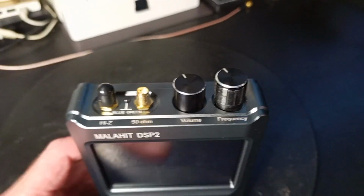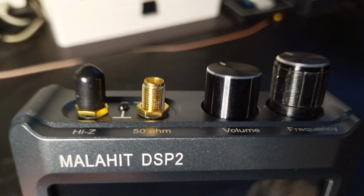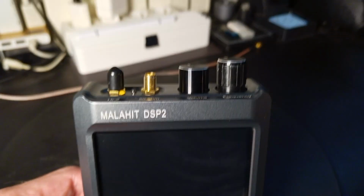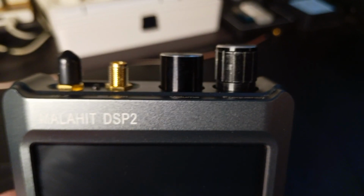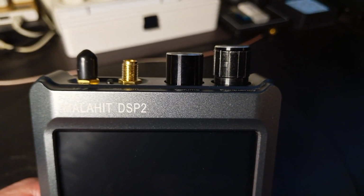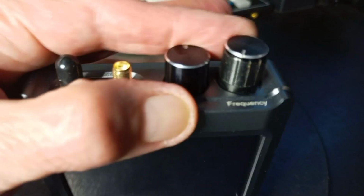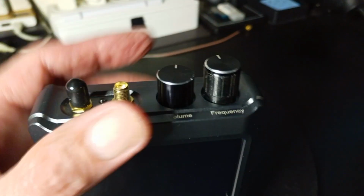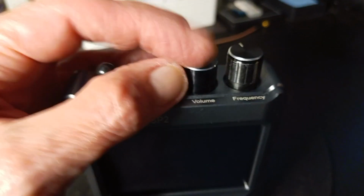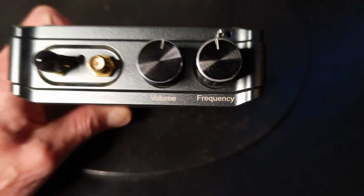These are these ones. They have no grip and a little bit sharp edge on the top, so it's not feeling nice on the fingers. So I exchanged the dialing knob, the dialing encoder, to a bigger one. It's a little bit higher. It feels more comfortable to dial the frequencies. You can now very, very comfortably work with it, and before this felt not very nice. So I recommend to change, the same diameter, but higher and with some grip.